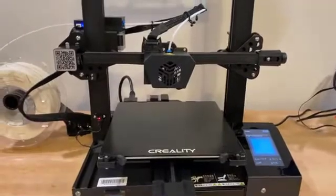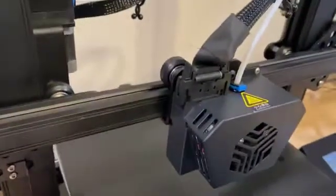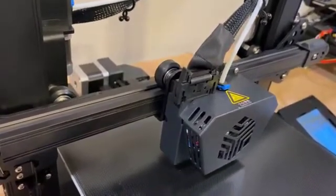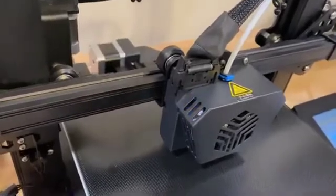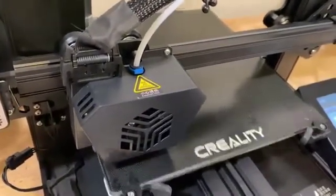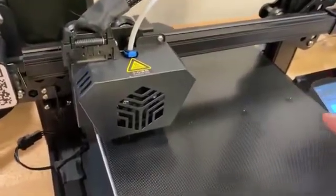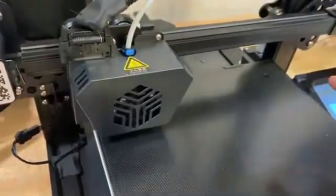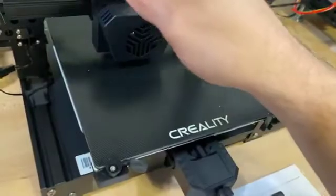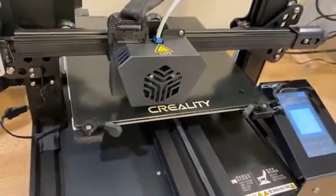So it's going down, and then within the print head — I think it's over on this side — when it touches the bed the little blue light will indicate that the sensor's been tripped. There it is. Then it does a 16-point grid and it touches it twice. It's actually a little different than the way ABL works. ABL will go from left to right, go down, and then right to left in an S pattern. This appears to go in more of what I call a search grid — it goes down, up, down, up. It's the same thing, just rotated, but it's different to see because it's not what I'm accustomed to.